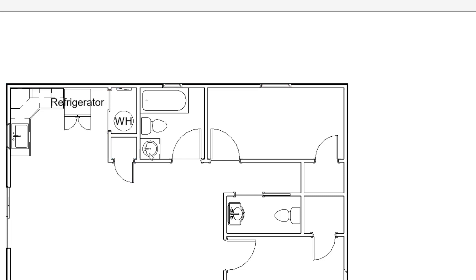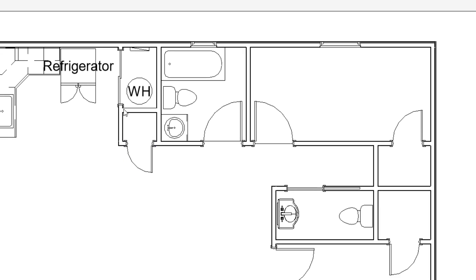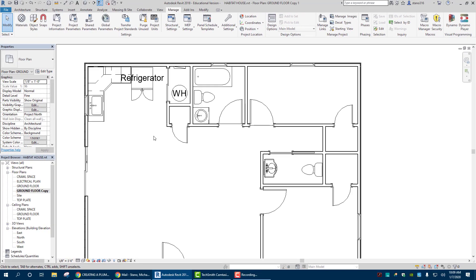Now the main water line for the house is usually going to come in somewhere near the hot water heater. In my house, I actually have it coming into the house right here. Then there'll be a digital meter for the water authority to monitor how much water you use. And then it's going to branch off into your water heater and then go to a number of different things. Since these are all on the same wall, it's actually going to have a line coming in, and it'll come out from the water heater for cold water, then go directly through the wall. We do have space under our house so that we can run piping underneath to different things, and we also have to go to this bathroom. If you're in a slab, you could run it through the slab or through the wall into the slab.